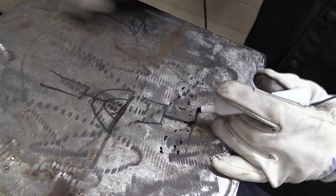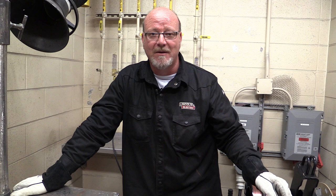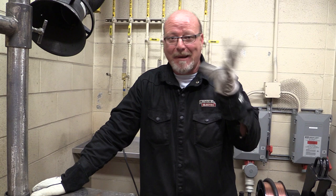The techniques are very similar. We always push pulse spray. We can run it up, we can run it down, we can run it in all the positions. The biggest thing to learn about this, though, is your arc length. Wherever your wire feed is set, whether it's 100 inches a minute or 700 inches a minute, then you have to go in and adjust that arc length. If you have any popping, crackling, spitting, spattering, you've got to take the time to adjust your machine in better. And that's always arc length.